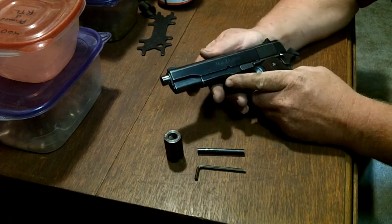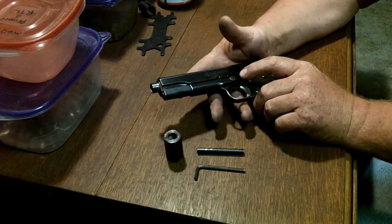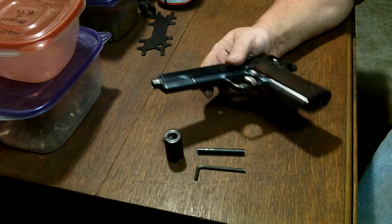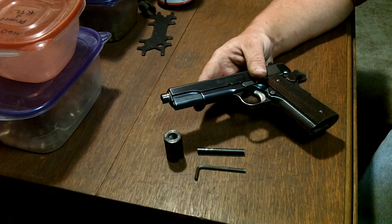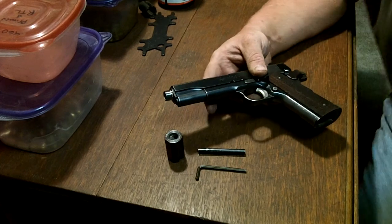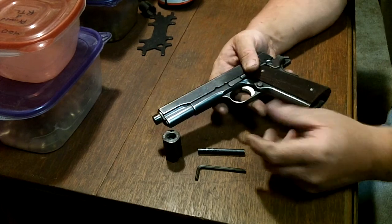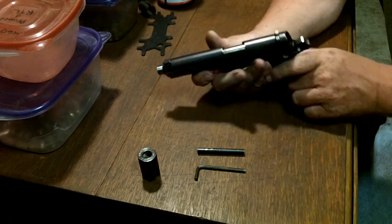The other main thing that's the big change and the big hassle in assembling these kits is the recoil spring. It's anywhere from — they recommend about a 20-pound recoil spring if it's a stainless gun. Stainless has more friction; stainless guns tend to have more internal friction, and you don't need as heavy a recoil spring to slow down and absorb the energy. Part of it also is you don't want the extra recoil spring tension because stainless tends to gall more — it's not as naturally slick as carbon steel. Carbon steel, they recommend like a 24-pound recoil spring, and that's what I've got in this pistol. A 24-pound spring is roughly 50% stronger than the recoil spring you'll typically find in a 1911 pistol.